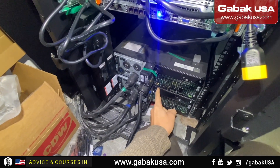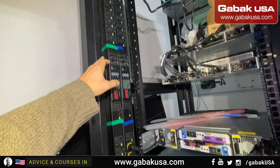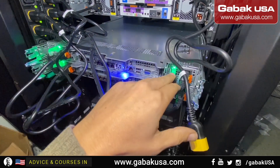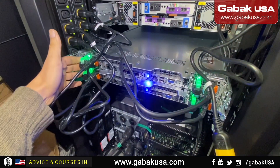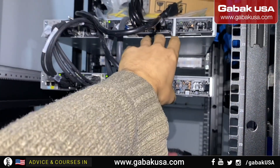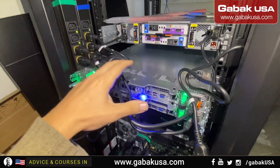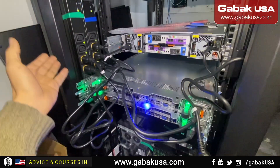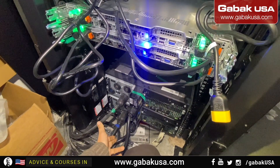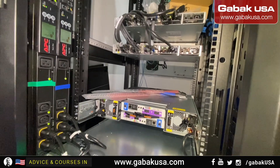As you can see here we have the UPS — the battery backup — one and two, and we have the PDU, the power distribution unit. All the servers have two power supplies, on the left and on the right. We also have Cisco switches and we have to plug them in later. This gives you redundancy: if something fails with one UPS, the rest of the equipment keeps working because the power will automatically switch to the second UPS and everything will keep working. That is how it should be done in all the equipment that you use for production.